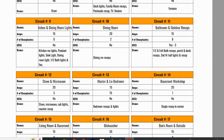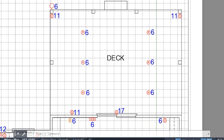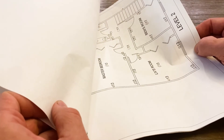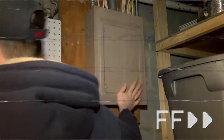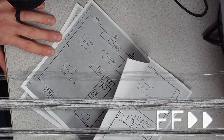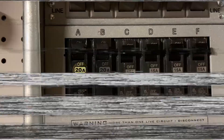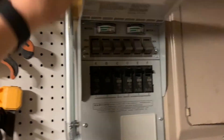I think this spreadsheet format is helpful — it's nice and clear with space to identify everything. The last thing I did was make a final circuit map with numbers next to everything in my CAD drawing, and I stapled that to the back of the panel ID sheet. Now I have both a visual and a spreadsheet version of every single circuit, outlet, and fixture in the house. This seems like a lot of work, but when it's done you'll have a tool available to you or anyone else working on your house, saving all kinds of frustration whether there's a problem or you just need to make a repair. Thanks for watching.